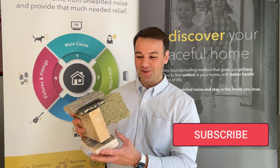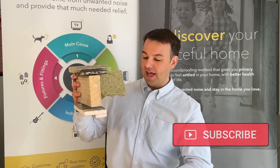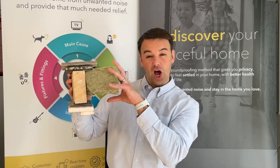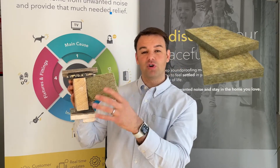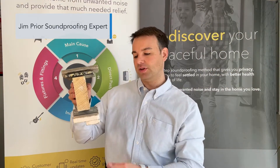Sorry for the crudity of my model here, let me go through it. We've got a joist — whatever size wooden joist that you may have. You've got a 100mm RW3 rock wool, 60kg per meter cubed. I'm just going to put that down there and then go through the rest of the model with you.